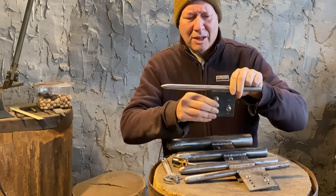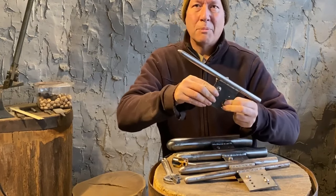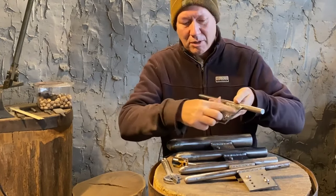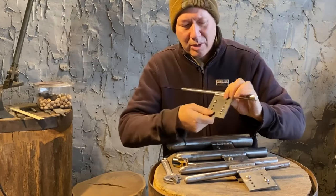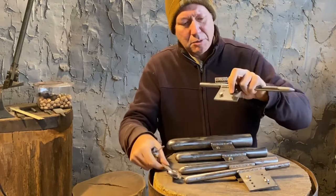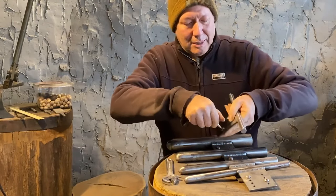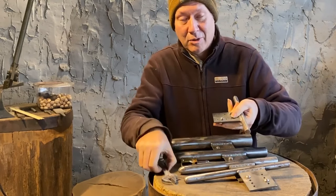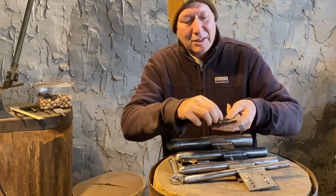This one right now I've got situated so it sits in my vise at about this angle. I actually want it at a bit more of an angle. I tend to use this one higher up. So I'm going to change the position of this screw. If I change this up one, that should do it. Use a Phillips head, and we've got a nut on the back. Often I just have this finger tight and I don't even need the wrench. And it seems to work fine.